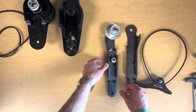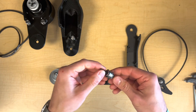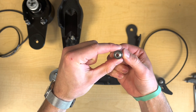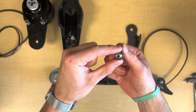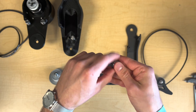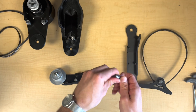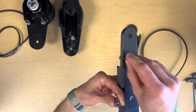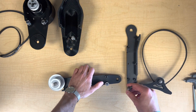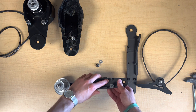We'll start with the shank and foot assembly. To give us enough slack in the belt to assemble, we're using three eccentric idlers which are mounted on this bolt. These will allow us to take out the slack by rotating the idler and pushing these bearings into the belt. Just by rotating that idler half a turn, we'll be able to take out enough slack in three places along the belt. I'm starting by loading the three idlers onto their mounting bolts on one half of the shank structure, and these bolts are also holding the two halves of the shank together.